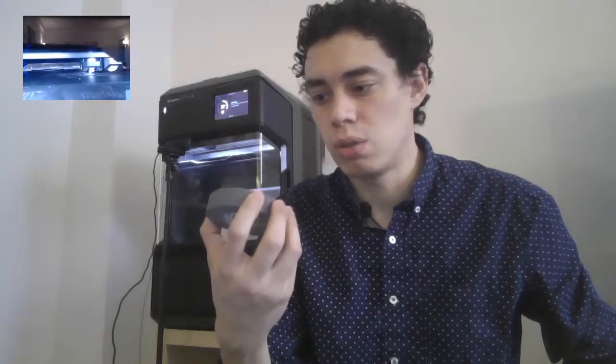Does the green part already have some mechanical strength? The answer is yes, but you shouldn't use it that way. I've been playing around with some of these parts. You can see, for example, this part is fairly sturdy already. It's really dense. I would say it's probably sturdier than my average nylon or ABS part, but you definitely want to run it through the sintering process. That's what guarantees the ultimate part performance. That's what guarantees that these parts are essentially solid metal now.